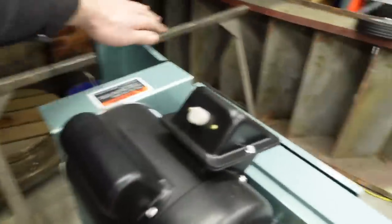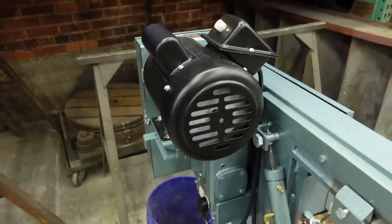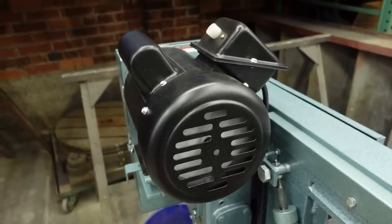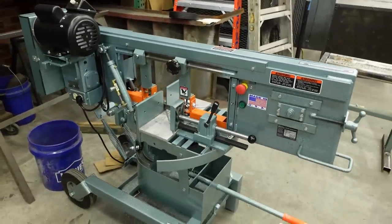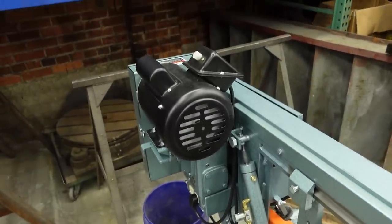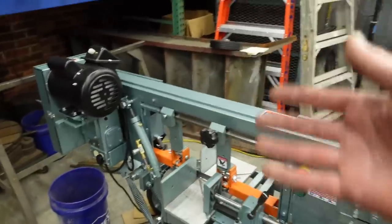The saw is plugged into an extension cord, probably a 50 foot extension cord. Let's see if this thing pulses like it has been. It's getting worse. So that's what it's doing. Once it's going it runs fine, but once you restart it, the problem's not nearly as bad and it gets progressively better as you use the saw. Frank from Arc 3 and I have plugged this directly into a 125 volt outlet on a 20 or 30 amp breaker that powers all sorts of other machines just fine, and it did the same thing. So quit telling me it's the extension cord — it's not the extension cord.